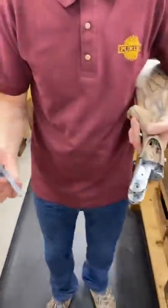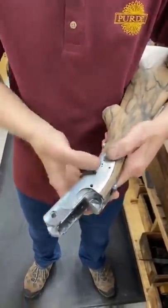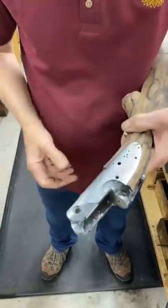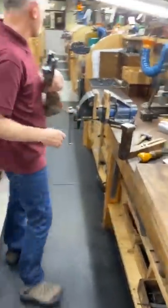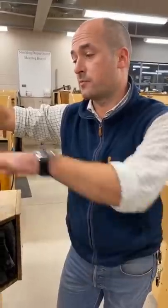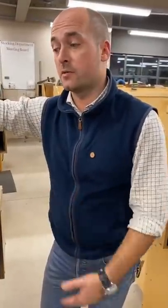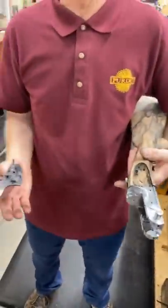Lock plates next, same as before, smoke black, tap them in, take them out, cut where it's bearing till we are easing down to the right measurement we want across the locks. All of this is really critical at the moment for later on in the stages when we come to do the finishing of the gun. Everything that Dick's putting in these positions here now will determine how we have to actually regulate the gun when it comes to us. So it's so vitally important, especially the hand pin and the angle of the hand pin and everything that comes through, for us to have enough room to get all the working parts actually working inside the gun. So it's so vital. We're trying really to leave as much wood in this as we can.